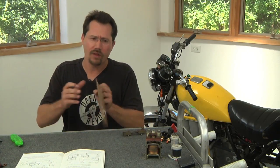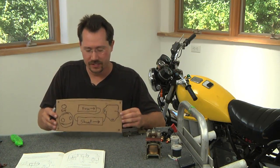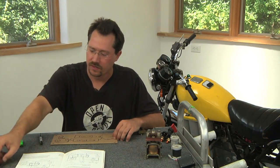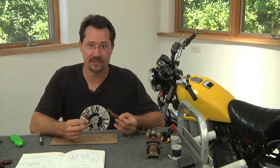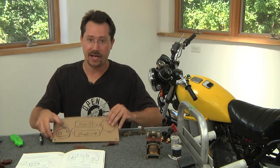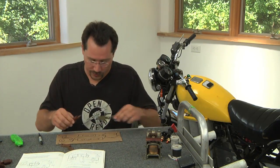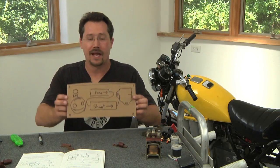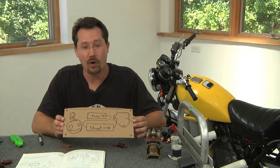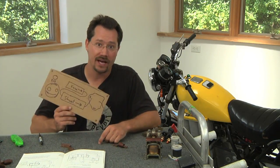Since all these components are going to be really close together, you might not have the flexibility with power cables to make them fit exactly where you want. In that case, copper bus bars work really well. Copper bus bars are just a conductor used in place of a cable — they're rigid, which works nicely when everything is mounted down together. You can put one on the end, see where the next component would lay out, and mark them in place. Now that we've got our cardboard-aided design layout done, we can use this as a template to make the same thing out of metal, mount all the components down, mount that into the cycle, and we've got our balance of system.